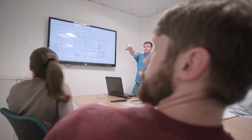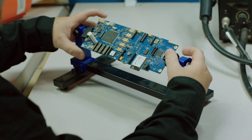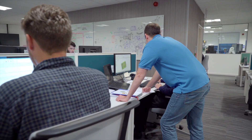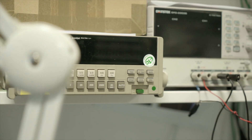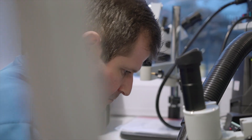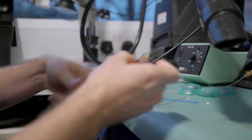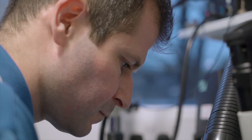We've done lots of different development projects for clients where we've been trying to embed intelligent devices into the connector. In order to test this product for AgTech and make sure that it was fit for purpose, we would do a series of electrical tests — straightforward contact resistance, insulation resistance, and low-level testing. But the key one was to make sure that this device, the EEPROM that was being moulded into the connector, was still functional.